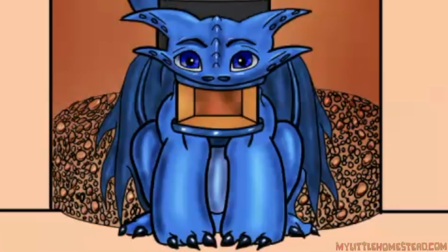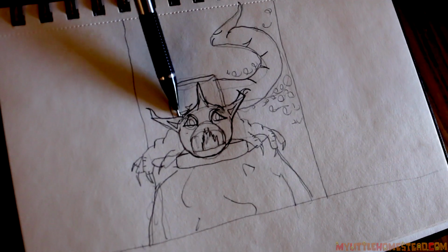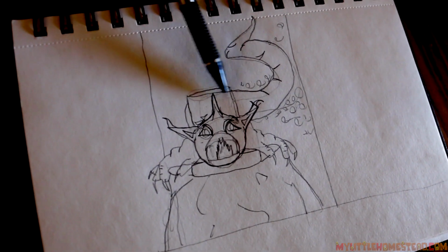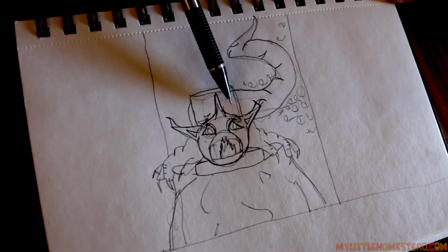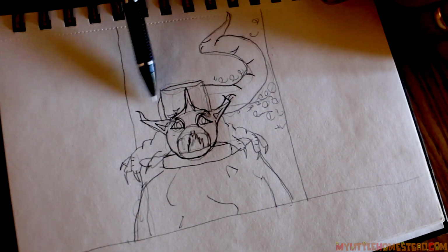But on this one, we've got totally new ideas, and we think that it's gonna turn out really, really well. This is the open flame area. This is the barrel that the rocket stove normally works from. Where we feed in will be through the mouth, so it'll look like a dragon and fire and so on. And on a wall that's about 18 inches thick or more behind this, heat storage will be on the wall as opposed to inside the bench.